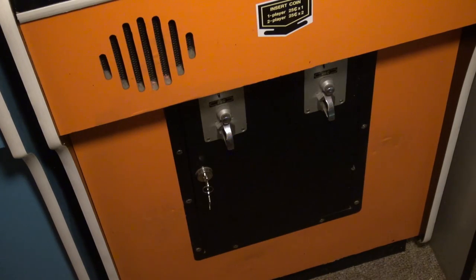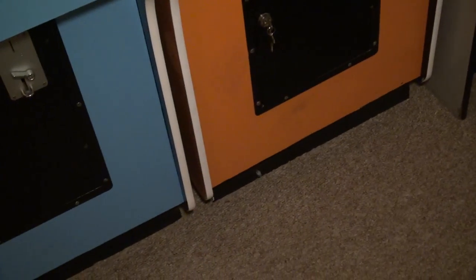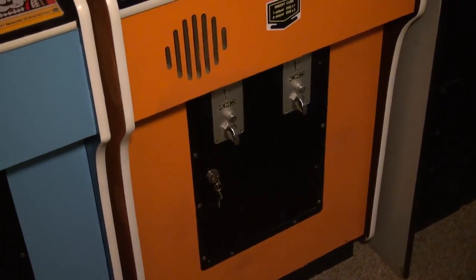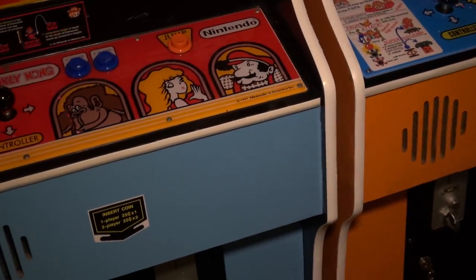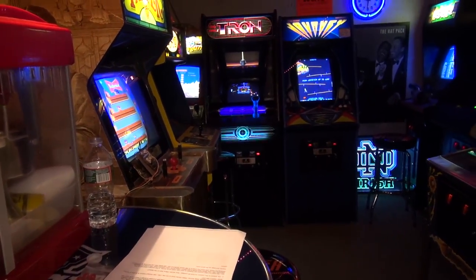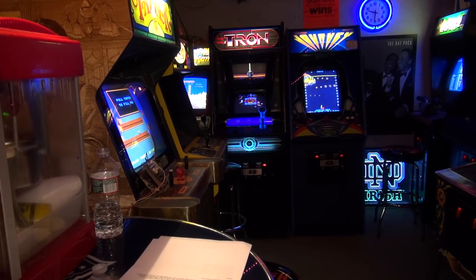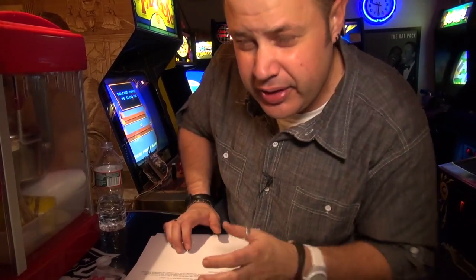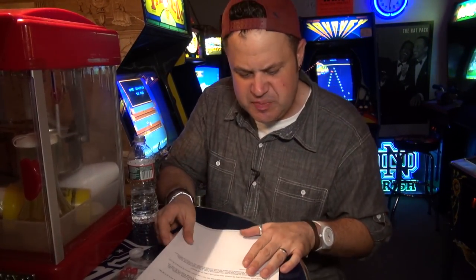As you can see, I did that here and it looks pretty good, doesn't it? Aside from my bad Bondo job, I think I did a pretty good job. I'm way better at Bondo now. I did that like 7 or 8 years ago. John was a bit of a noob then. Today, if I encountered those holes, I'd use dowel rods. Back then, I was always trying to fill the holes with Bondo, and that just doesn't cut it. You gotta really fill a majority of the space with something else.